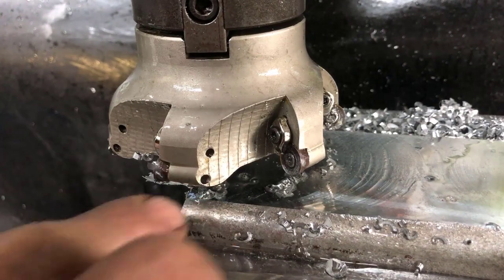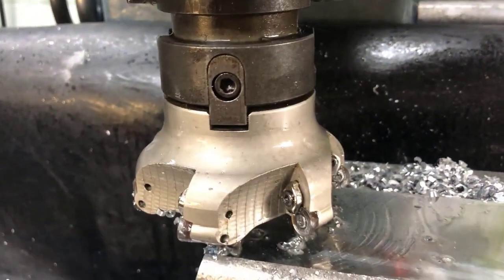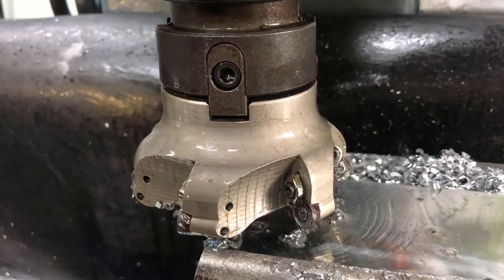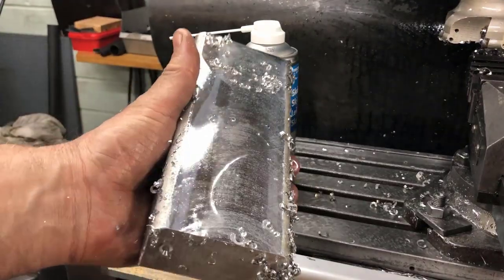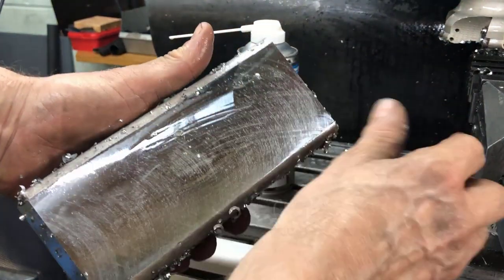As I was saying, when you get to the end here you get a little bit of interrupted cut. I think inside the head there are several shafts — I guess a bushing is a little bit worn — because you'll have a tendency for chatter when you have interrupted cuts. That's where you have a real benefit of playing around with both the stepless feed and stepless RPM to find a sweet spot. I think the results are acceptable, at least for such an old mill, and by amateur means — this is okay enough for me.